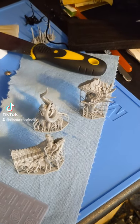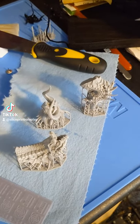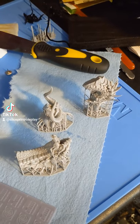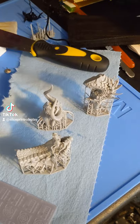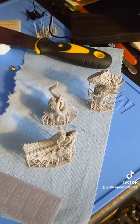Because what's happening is all the little bits of resin that you put in there to get washed off of your parts are now floating in that solution and probably creating a thin film on your parts. So once you take them out and let them dry and cure, most likely they're going to be sticky even after curing because they have that thin film of partially broken down resin.